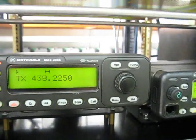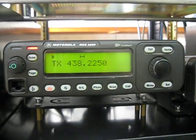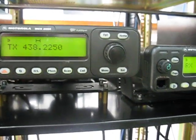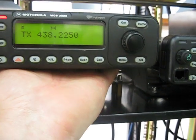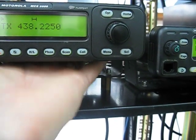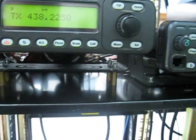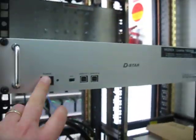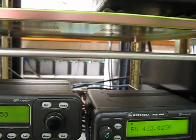It's been transmitting fairly continuously for the last hour. I gave the repeater a quick two-way test before the net started. The fan is keeping the transmit radio relatively cool — it's warm, but not as hot as it gets without the fan. One thing I've changed in the configuration compared to the ICOM D-Star Repeater, which is sitting next door turned off, is I'm running this without the 1MHz wide bandpass filter.